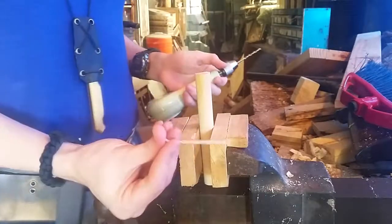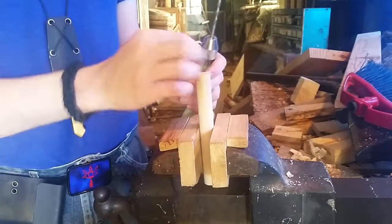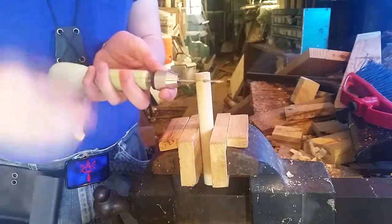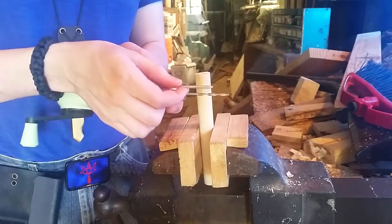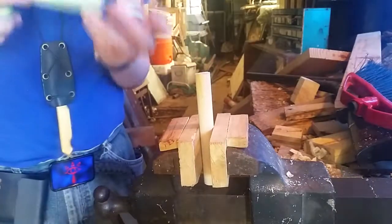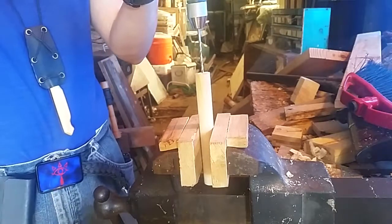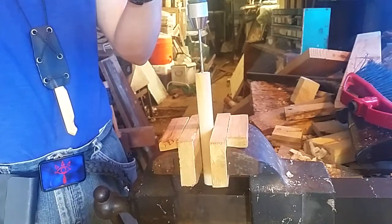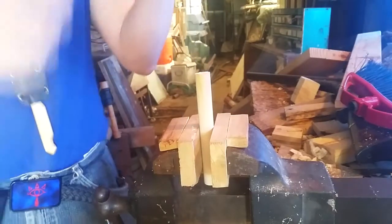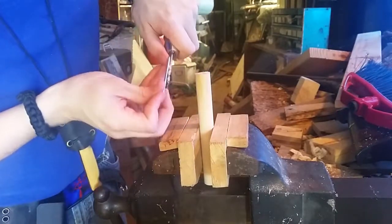With the hole set, I'm going to be using this nail to make our vampire dog. In order to do that I need to pre-drill it, because this is a pretty hefty nail and it will destroy this dowel otherwise. So I chose a drill bit that is slightly smaller so it still has something to grip onto. I have my hole preset and now we're going to drill that out.